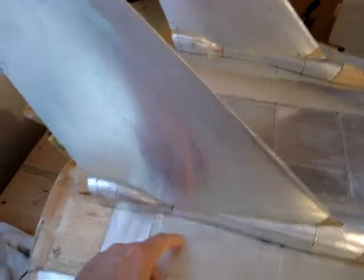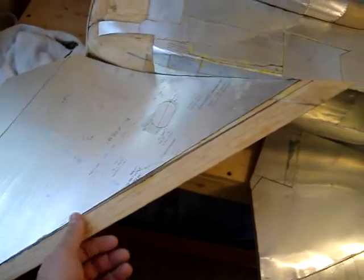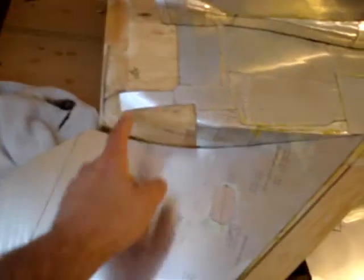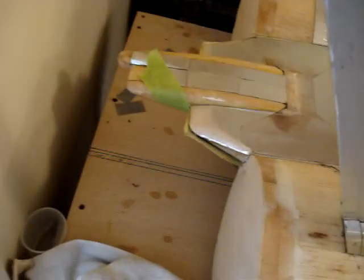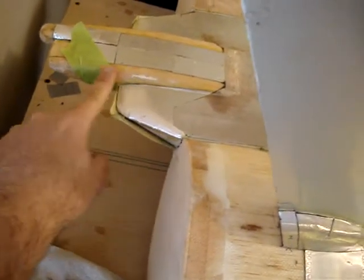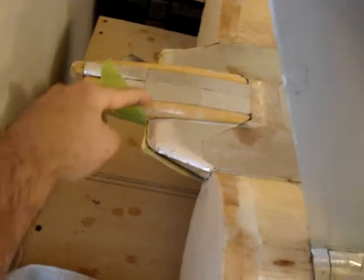The vertical tails are basically done, minus a couple of reinforcement strips that'll run up right here that I've got to get some aluminum stock for. Horizontal stabs are again mostly done except for the leading edge, which I have to get some longer material to do in one piece. Then there are some antennas that go right here on both of them. The tail section on the fuselage is done except for the one panel here on both sides — that should be a fun one because there's a lot of different curves to it and it's all got to be one piece. Then there's the beaver tail area I was talking about earlier; these panels overlap from the bottom around and then back up to the top on both sides.